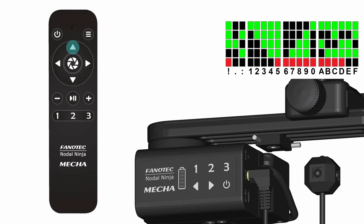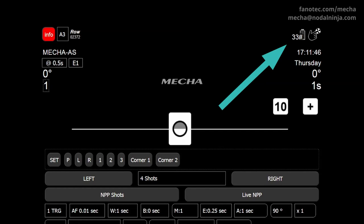Up arrow button: 2-3. Down arrow button: 3-0. Center button: 2-5. Menu button: 2-2. The code is also displayed over the battery symbol on the user interface. This helps you perform the test with the commander at a greater distance from the receiver. All of the buttons must pass the test in order for the test to be considered successful. To end the test, press the power button on the controller.